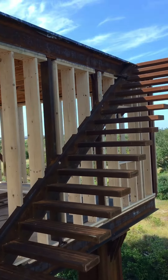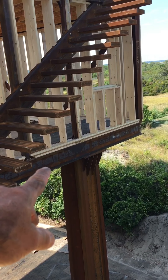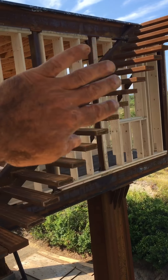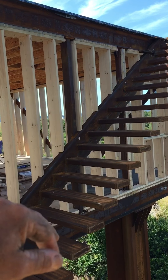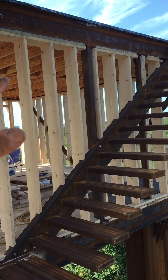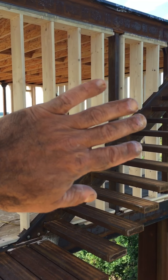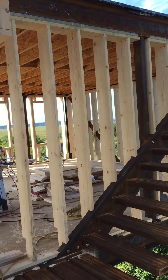There's the staircase in that frame wall. We're gonna insulate the beams and put blocking to accept the plywood — going with three-quarter inch tongue and groove on there. We'll insulate there, put a curb up first, then sheath the whole exterior with plywood. Then we'll come along and put blue skin over it, which is an air seal and rain screen — a permeable material that allows moisture to escape if it has to but won't allow rain in. So it's sealed and protected, and when we can't get to the sheathing and insulation for thermal bridging right away, it will be sealed and protected.